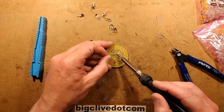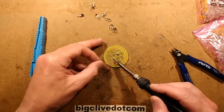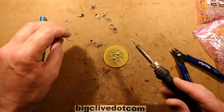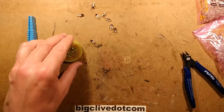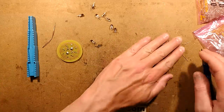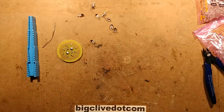An interesting thing is the resistance of your USB lead will play a significant part in how bright the LEDs are and how hot the lamp gets, because if you use a cheap, crappy lead that isn't really capable of passing an amp without a significant voltage drop, then it's not going to operate at full capacity. So use a good quality lead.